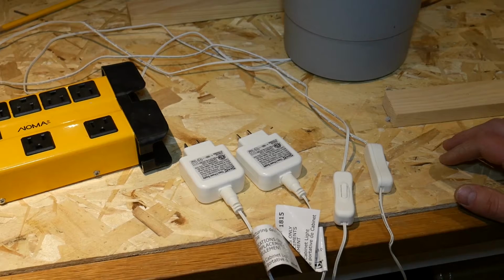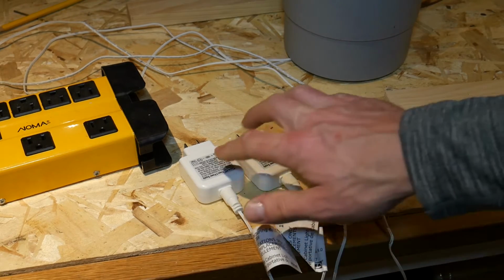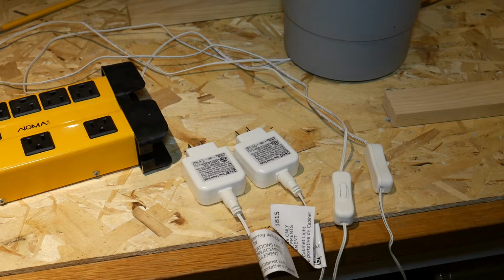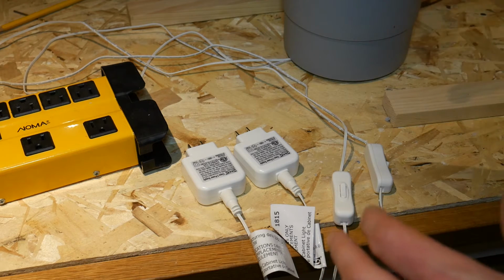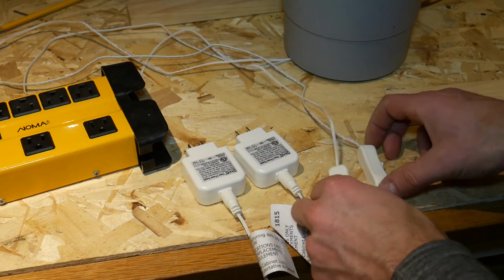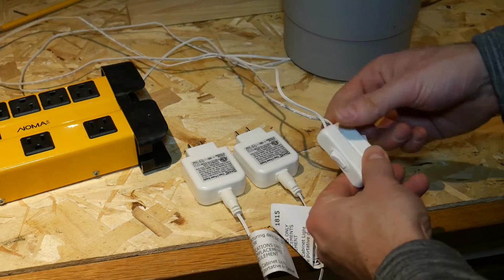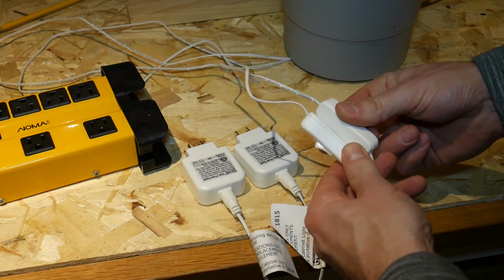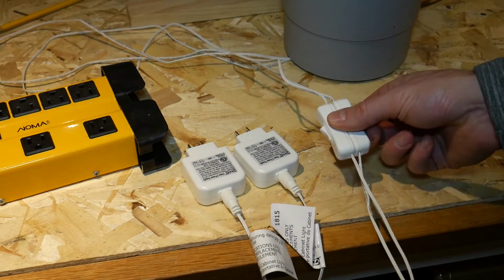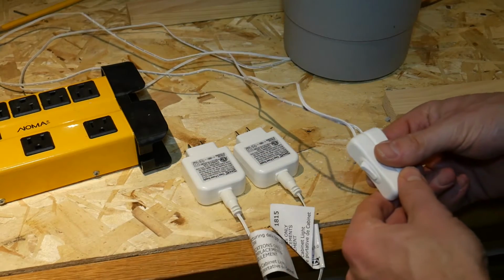Now we're left with the remainder of the wiring, which consists of 2 switches and 2 plugs. This is of course because we used 2 LED kits for this project. If you are not into soldering or you're not confident enough to do that, you're pretty much done here, and you can clean up the wiring by bundling it together, as well as double-side taping the switches together on the back, so everything looks nice and neat. Plug them in, test them out, and everything should work.